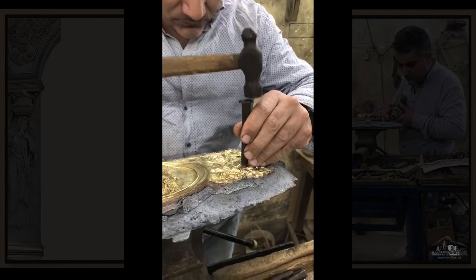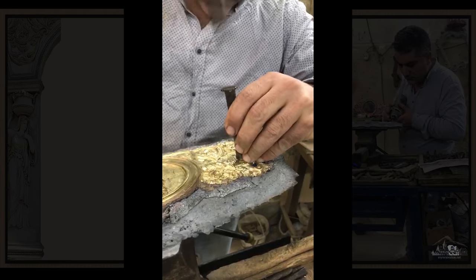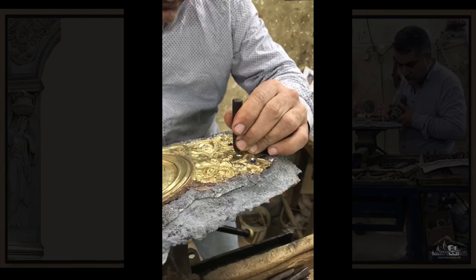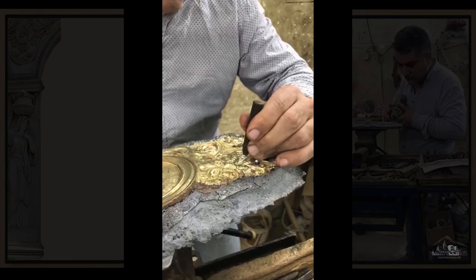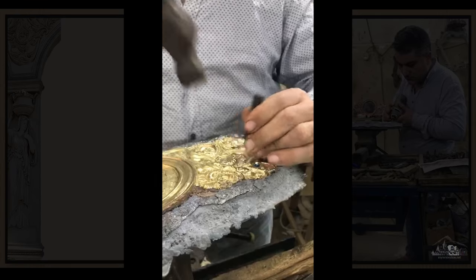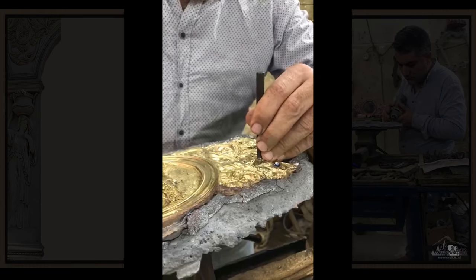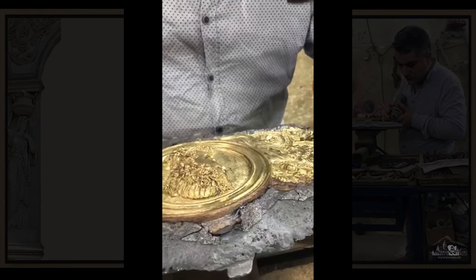piece after taking it from the box and removing any extra edges, removing the dust from the piece, creating more design and curving edge on the piece, sanding and polishing process to remove any extra edges, adding extra details to the piece, adding edging, shining, and details to the piece. Final touch and apply coating. Adding gold coating and bake in a 200 degrees Celsius oven for about 1.5 hours.